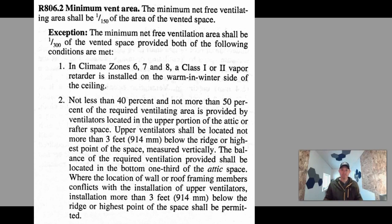Let's talk about re-roofing. Maybe you've got asphalt shingles, metal roofing, or whatever you have — if you only have one existing layer, which most of the time applies to asphalt shingle situations, you can potentially do a layover. Clay roofs, metal roofs — you're not going to have multiple layers of those. You might encounter a wood shake or cedar shake situation; I've seen this a lot where the original roof is cedar shakes and then three layers have been put on top. Because there's more than one existing layer, the roofer has to tear it all off down to the skip deck or sheeting and start over.